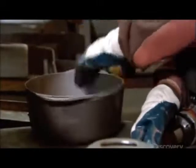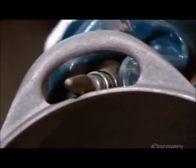At this stage, the cookware has rough excess metal where the two parts of the mold met. So now workers smooth away these burrs using a grinding wheel on the outside and a grinding pen in the tight spots. The cookware is now ready to be prepped for enameling.